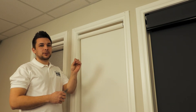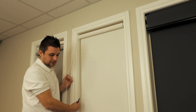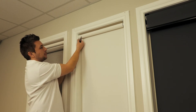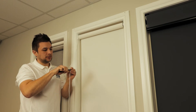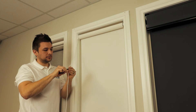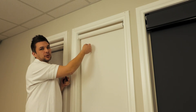We're going to install the chain stopper now, which is the small plastic ball that was supplied with your roller blind. Move the roller blind and get the base rail as close to the bottom where you want the roller blind to stop. Grab the ball closest to the control and install the chain stopper — squeeze it over the ball. This is going to stop your roller blind from over-rolling and falling off the tube.